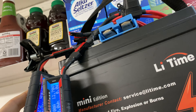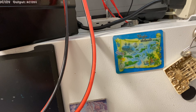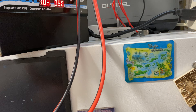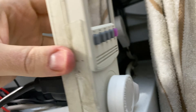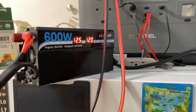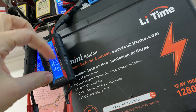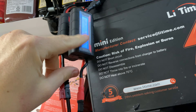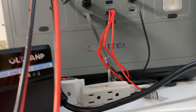Up here it's only showing 7 watts, and on the other meter also 7 watts — but you can hear the compressor in the background so it's probably taking more. Now it's jumped up to 91 watts. So it can handle the fridge. With both cables connected and the load split — roughly 46 watts from one and 45 from another, about 90 watts total — there's maybe a 10% conversion efficiency loss. The fan is off at this 90-watt load.